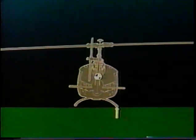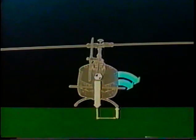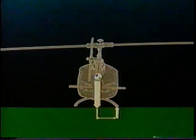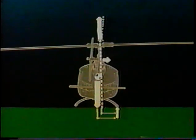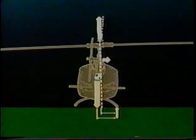We'll hold at 2 degrees so you can see what happened. For one thing, the reaction force under the left skid is gone. So the weight of the aircraft is pivoting around the right skid alone. This has moved CG over the ground rightward toward the skid, beginning to shorten its moment arm, and so reducing its stabilizing ability. Further, you've set all that weight in motion to the right, and its momentum is going to keep it going that way until some force acts to stop it, and it will keep accelerating as long as collective keeps increasing. If you haven't recognized what's going on and started recovery procedures, considering we're only a second or less past applying collective, hard to believe as it may seem, you may already have lost control of the situation under certain critical conditions we'll talk about later.